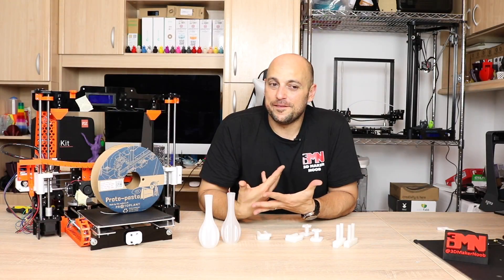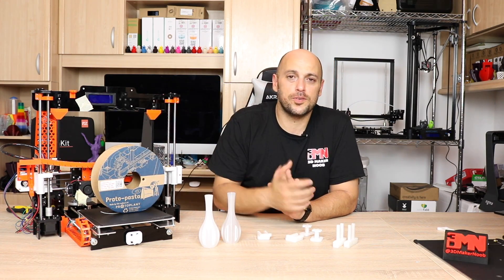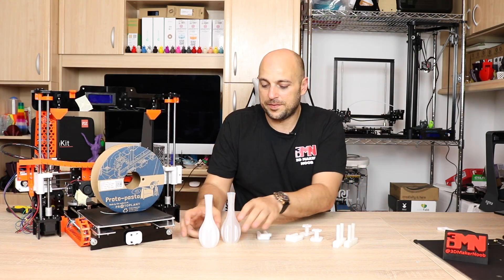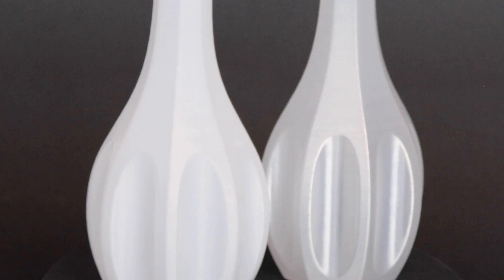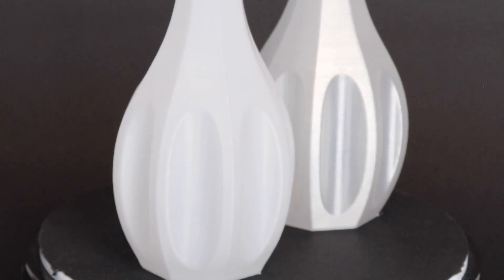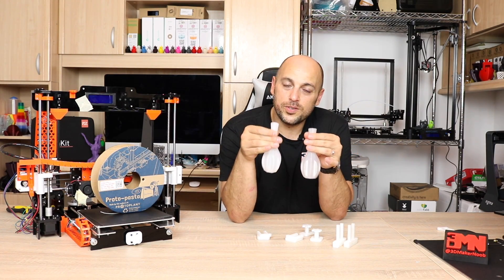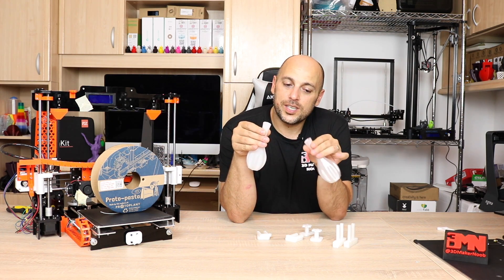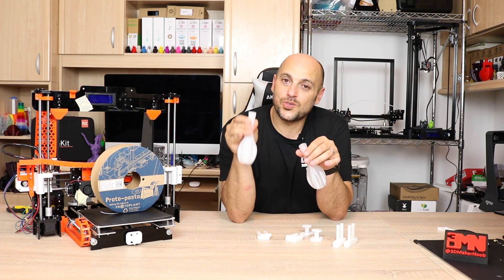Next I thought, let me try it in vase mode, because I print quite a lot of vases that I leave around the house. So I printed these two vases here — one is still as-printed and the other one is cooked. As always, the uncooked one is still translucent and the cooked one is opaque, so it's very easy to tell which has been cured. In terms of strength with one layer, the difference isn't huge, but when you squeeze the throat of the vase you can tell the uncured one is almost about to give up, whereas the cooked one is much stronger at the throat.